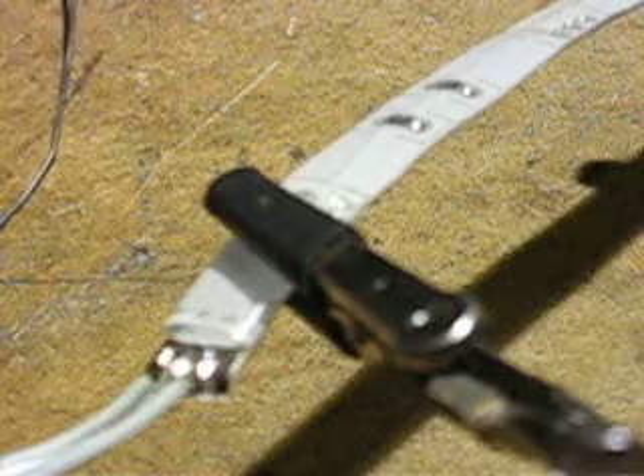You tin your leads, and then it's just a simple matter of applying a little bit of solder and soldering it up. For anybody using a temperature controlled soldering iron, I'm actually doing this at 380 degrees. I've been told this is a bit cold, but I find it works ideal with strips. I hope you found this helpful.